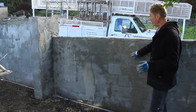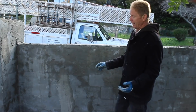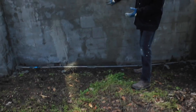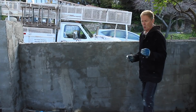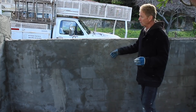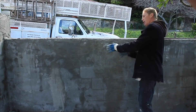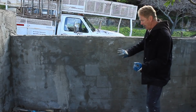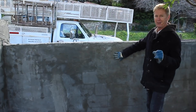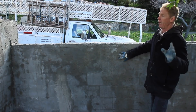It's actually not a good idea to put a bonding agent over clean concrete. If you look at this block wall, you'll see lines in it because what I did the other day was pressure wash it. I had to account for a lot of things like the mud — I pressure washed it with 3,500 PSI using a gas-powered pressure washer with a turbo tip, so I gave it extra strength and micro-etched it. This was done about six months ago and you mow the lawn, the dirt goes up and gets all over the wall. So today we're talking about hydration, the importance of it, and bonding agents. Do you need one on a painted surface? Yes. Do you need it here? No — in fact it would be counterproductive. So no wire, no stucco netting or mesh or bonding agent.